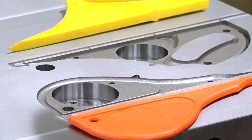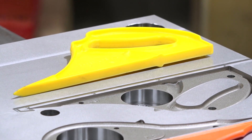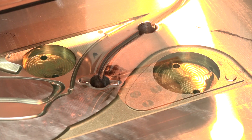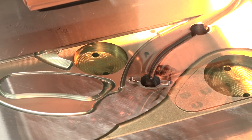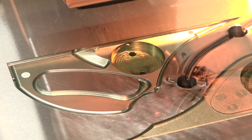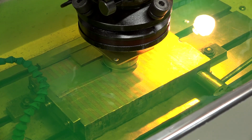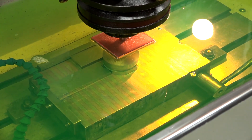What types of applications are you using on these machines? We specifically use them for creating our cavities for our injection molds. They're incredibly good for achieving very consistent finishes. The tolerance based on power is very, very good. The most important thing to us is the versatility — the ability to clock the electrode in all directions. We're really happy with them.